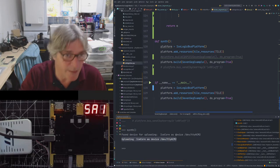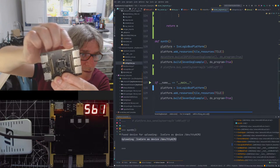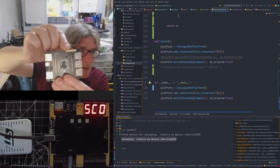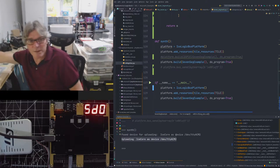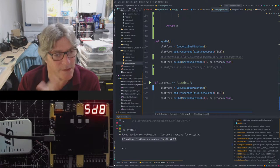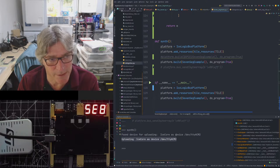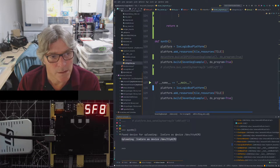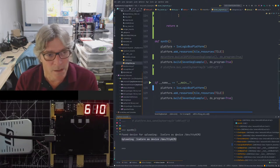Now, I've been reducing the aperture on the FPC connector for the FMC bus slash display on here. This is a very high pitch. This is the same pitch as those pins, but there is more space between the actual conductors and each other, rather than the tiny gap that you get on the TQFPs. So yeah, it was very frustrating on Monday building those, because I thought I'd reduced the paste enough that that shouldn't happen, but it was still happening. I was still having to use flux to actually clean it afterwards, to debridge it.